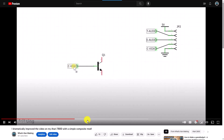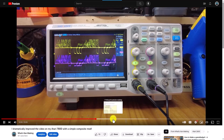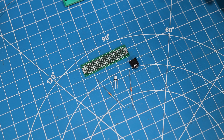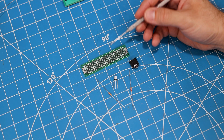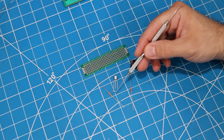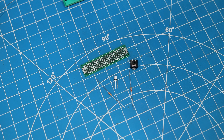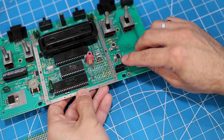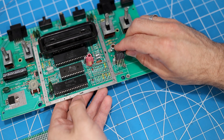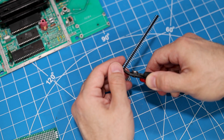If you want to understand this circuit more, go check out my Atari 7800 composite mod video, where I hooked the circuit up to my multimeter and oscilloscope and walked through the effects of each step as I built it out. To do this mod, we're going to need just a few components: a 2N3904 NPN transistor, a 3.5mm audio jack, a 3.3 kiloohm resistor, a 2.2 kiloohm resistor, and of course our perfboard. For mounting, I thought we'd just use a header directly into the pins that the RF modulator was using, and then use these angled pins to connect our board. I trimmed down the header because we don't need to connect all five pins, and I snipped off four angled pins for the board.